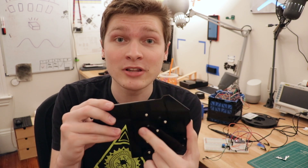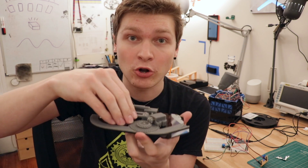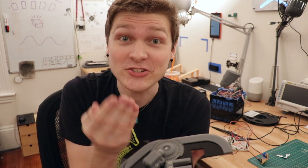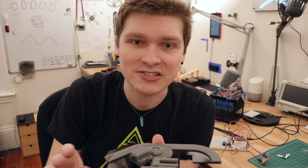Now I was hoping to integrate them all together with the optical sensor. I could just drill a hole in the back of the acrylic and hold the sensor behind it to pick up the little slots. Well, not really — it didn't see it very well. So instead I'm going to hold it over the top. The sensor will ultimately be soldered onto what is now acrylic but will be a PCB, so this won't be a problem once I order a circuit board. For now, this is a nice way to just test it.